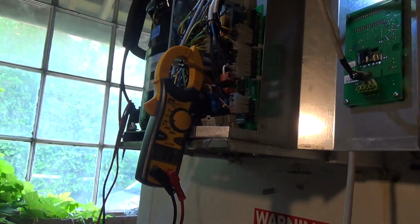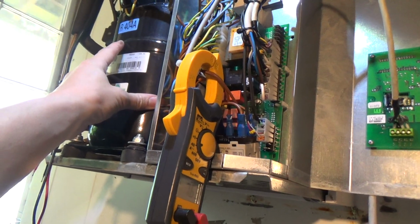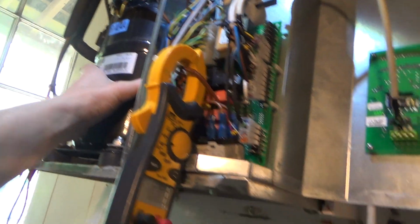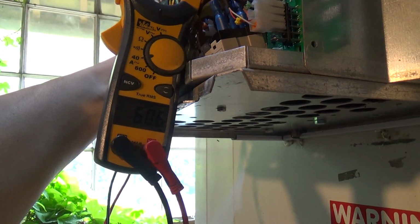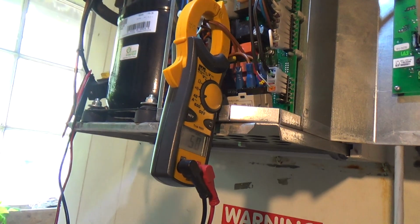A lot of these things, they put a low back pressure compressor because this could run as a freezer, and they sell them as running as a chiller as well. So they do put a lot of current. When they first rated load amps was 5.7. They're kind of overloaded at the start because when it's been off, all the pressures have equalised.